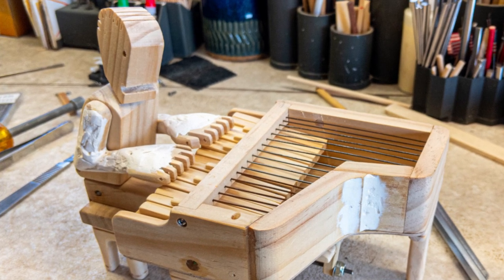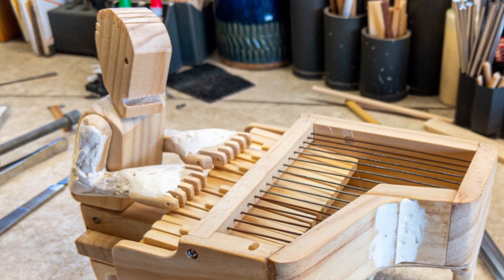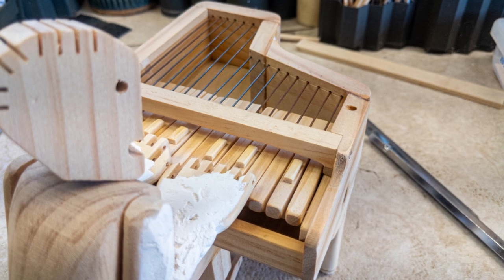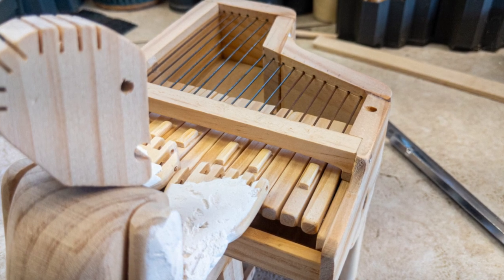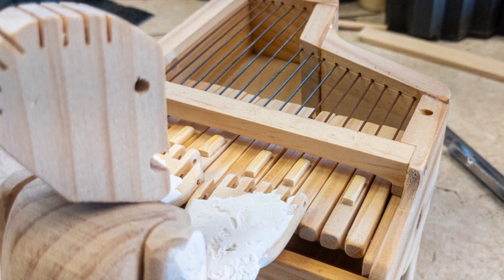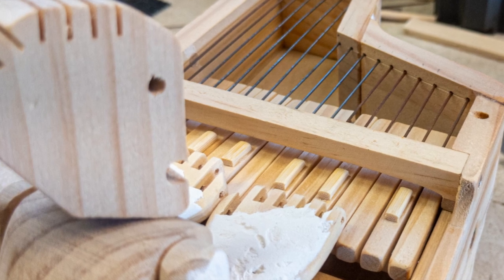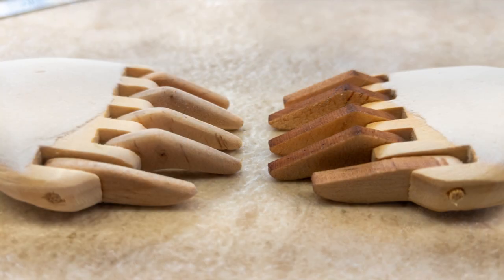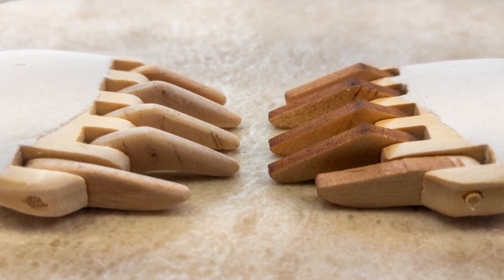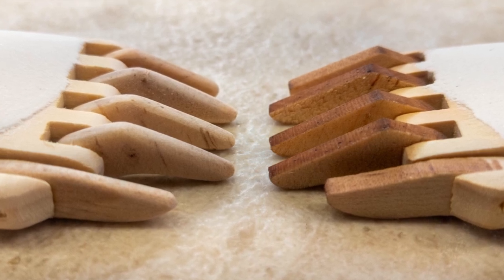The largest deviations that I made with the pianist were: one, the substitution to a 3D printed head; two, the addition of piano strings, which required a re-engineering of the device that causes torso and foot motion; three, the substitution to stainless steel shafts; four, the addition of several ball bearings; five, the bulking out of some of the wood shapes with wood putty and fillers to enhance the shape of the pianist.